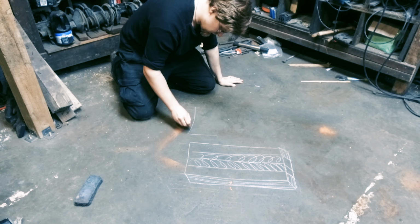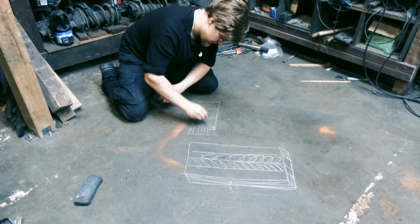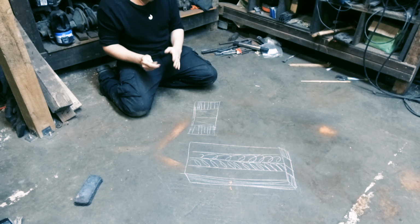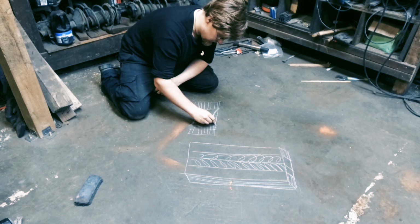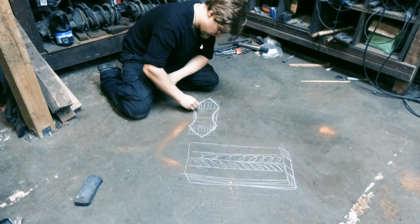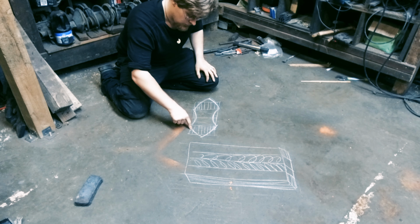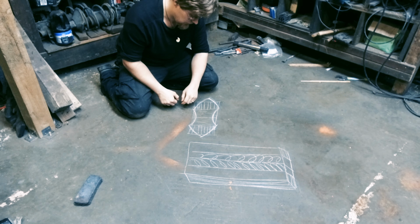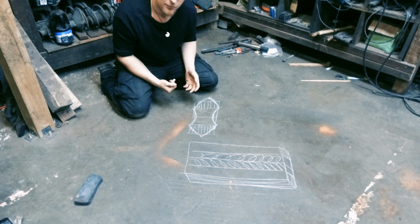But you've got an end grain view of the billet. When I go to grind the blade, I'm going to be hollow grinding in this section of it, and then I'm going to be grinding the bevels. Again, this is an exaggerated view, but just for you guys, grinding the bevels. What this will do is bite into those layers to bring all of these layers to the bevel surface. It'll get rid of these hard corners, and I won't have to do much patterning after that point, really. The grinding will determine what the pattern's end result is going to be.